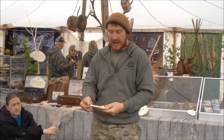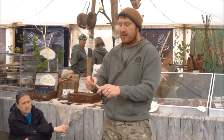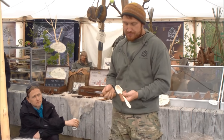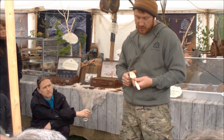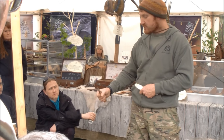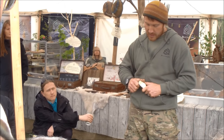To improve the thumb grip cut, rather than just pushing, keep your thumb fixed and swivel the other hand — it creates a pivot point and increases the slicing efficiency, giving a much smoother finish. That's a good grip for the back of the bowl and for smoothing the back of the handle. One thing people do wrong when working around the curve is use their thumb as a backstop, cutting back towards themselves straight into their thumb. Keep that thumb tucked well out of the way, using only the leverage of your fingers.